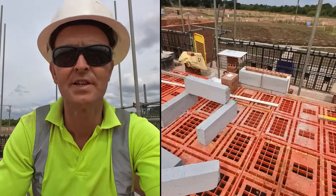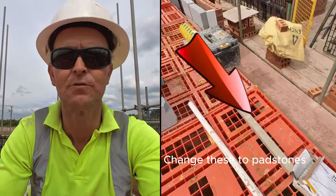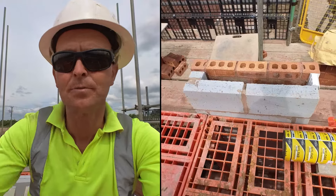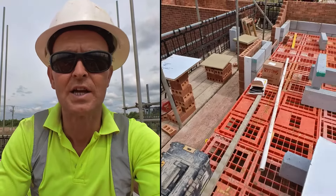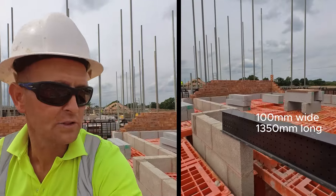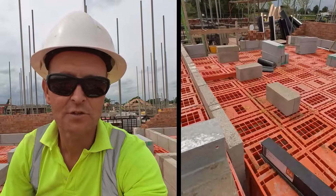The back is 225 deep, same as a block, so your blockwork sits on top. The flange always goes outside. When you have them lifted up on these two here, they need pad stones — it wasn't on the drawing for pad stones. These box lintels BSD 113 50 are for internals, over your doorways.